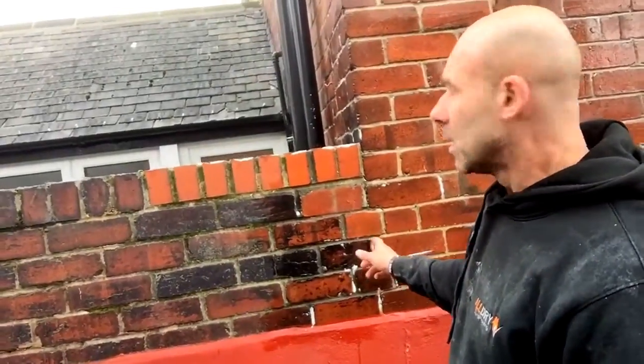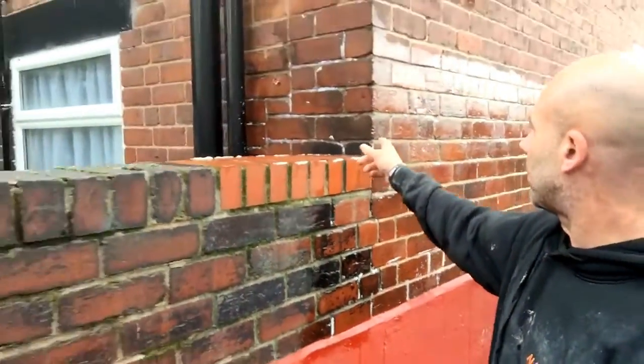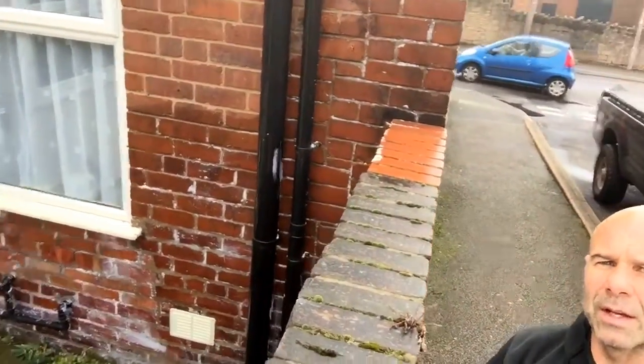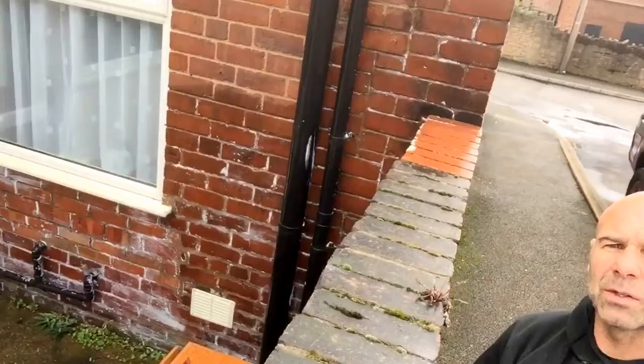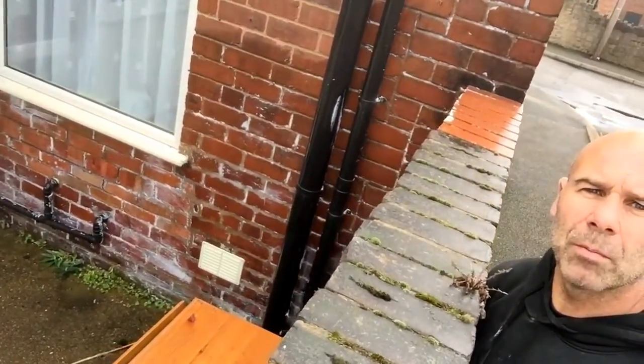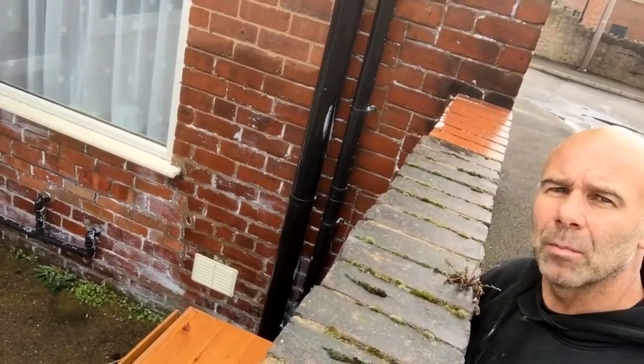I'll just show you on this side of the wall. Big cracking wall, nasty gash. Splashing back up the wall here. And then if you look down here, you can see there's loads and loads of pipes at the bottom. Rainwater splashing back up at them, penetrating into the property because it's a solid wall built from headers and stretchers — as most properties are — 110 years old.